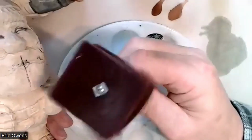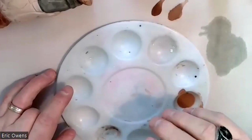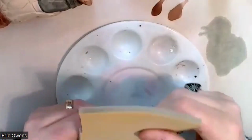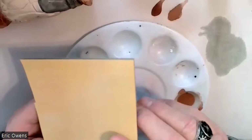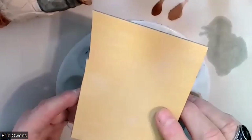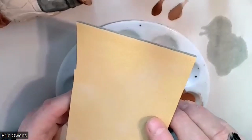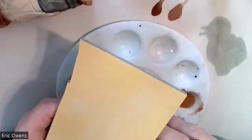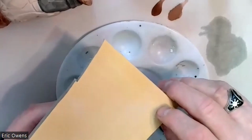This is what prepares my wood, because let me get on not my soapbox, but get on my preacher's pulpit. Sandpaper is one of those things, and here's a piece of foam back sandpaper that's really good for that because it's very flexible. Sandpaper is one of those things that can easily ruin a carving, and it can easily get too much for you to do. So sandpaper, the roughest sandpaper I've ever seen is 60 grit, which means there's 60 pieces of grit every square inch. I've seen sandpaper as smooth as 12,000, and I'm sure there's even more.